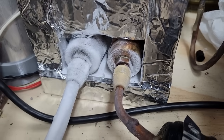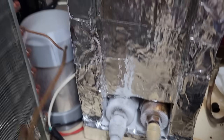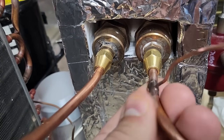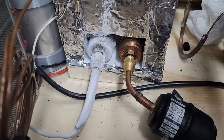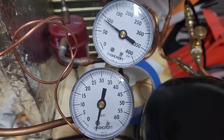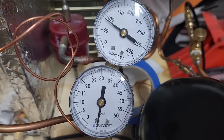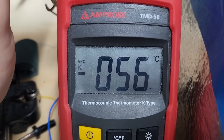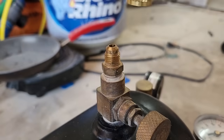Here's a closer look at the intercooler in action. The first stage inlet and second stage outlet are iced up while the first stage outlet and second stage inlet pipes are basically room temperature. I'm running this first test with propane in both stages just to verify that everything works. Once everything checks out, I'll switch the second stage to ethylene. The condenser pressure is running at a mere 90 psi compared to the first stage's 200, and the evaporator is sub-atmospheric. With propane I bottomed out at minus 56C, a good bit colder than the single stage unit, but not as cold as it could be with ethylene as the refrigerant.